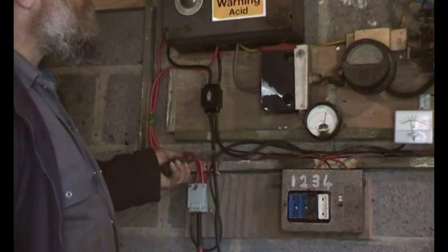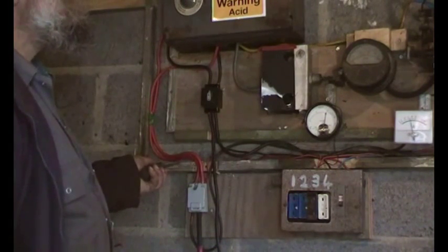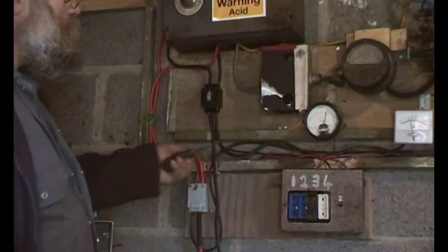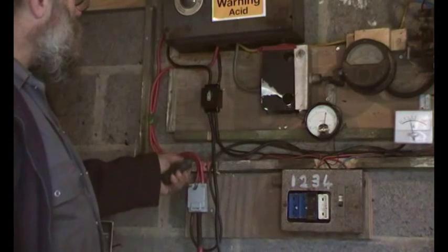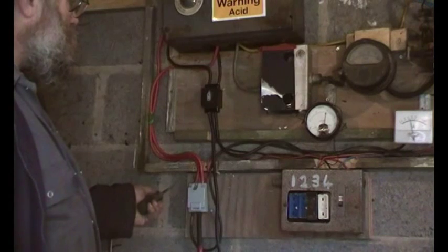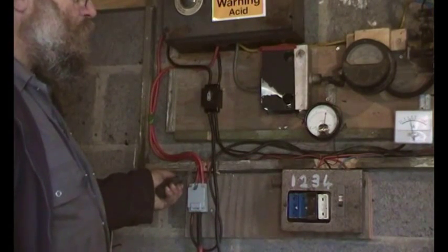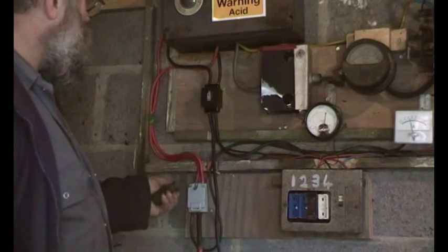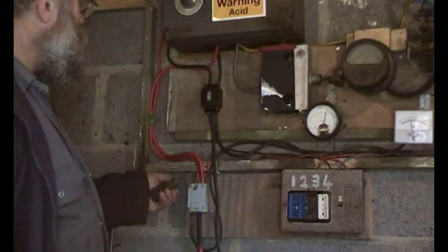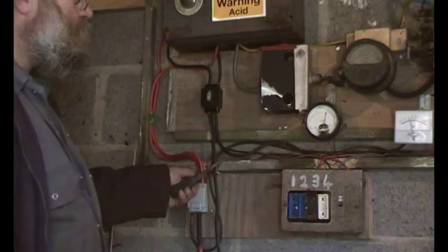Then this red wire here is the control circuitry. So reasonably simple as per the drawing, and when you see it, it sort of makes sense now. But I'm starting to box everything in to rationalise stuff, because when you're building you go, well, where am I going to put this? I'll put it there. And then when you slowly tidy up after you're happy with how everything works, you have to move things around and keep the tails as short as possible from various items into the trunking.